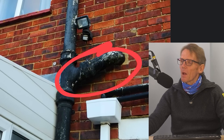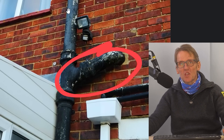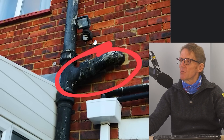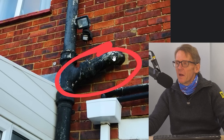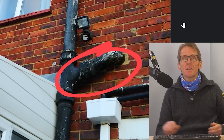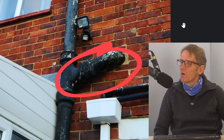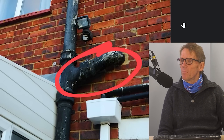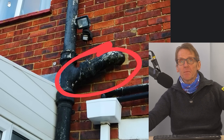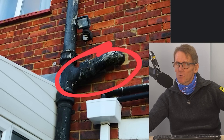My local authority - if you put asbestos into special polythene bags marked up as asbestos material, tape it all up with duct tape, and take it to your local authority waste transfer or recycling place - a lot of them will take asbestos. They take it to landfill; nobody touches it, it goes in sealed bags deep into the landfill so it'll hopefully never be disturbed again - a bit like nuclear waste really. So you can pay to have it taken away, but it may be possible to do it yourself.